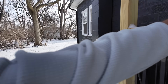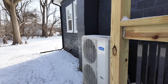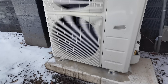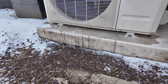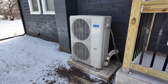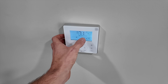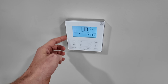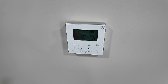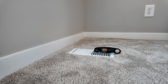Here is the outdoor unit. We're barely over zero degrees Fahrenheit right now — it was negative last night, no snow cover. The unit's been working hard and you can see quite a bit of condensation coming off and immediately freezing at the base. With these temperatures, let's go ahead and see what kind of temperature we can get out of our registers using just the heat pump. We're commanding 71°F as our set point on the standard Mr. Cool thermostat — it's in the heating cycle, fan set to auto, with the room temp at 70°F.